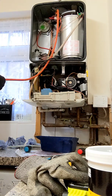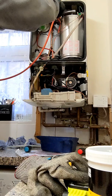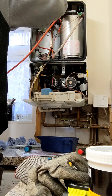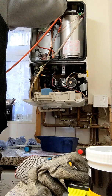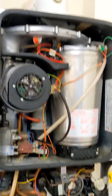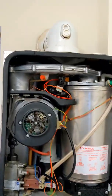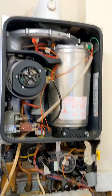Just going to vent the top of the main heat exchanger — I normally attach a bit of u-gauge hose to it, direct to the sink. All right, that's all vented. And there we have it — new main heat exchanger in the Worcester Greenstar, all done. Pressure's holding, no leaks. Now just got to do the 26.9 checks, pack it up, and on to the next one.